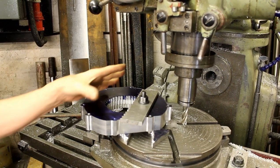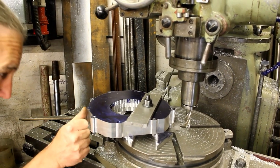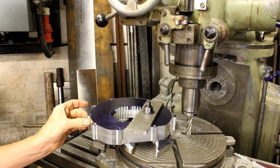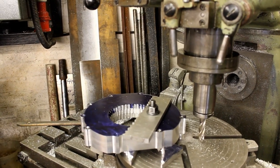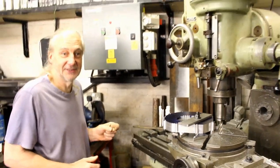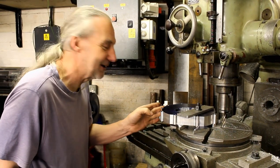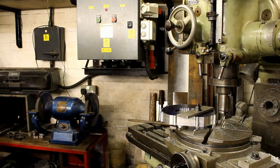Because that curve is not a perfect curve, I've had to move it on the table on a special clamp just to try and get it right. It will want a small bit of finishing - probably a little bit of wet and dry just to polish a few marks out. If you had a CNC you could program it and whip them out in about 10 minutes, though it might take three hours to program. For a one-off it's not worth it.